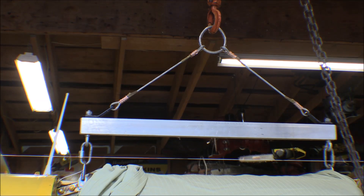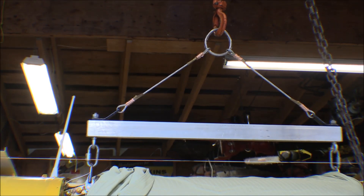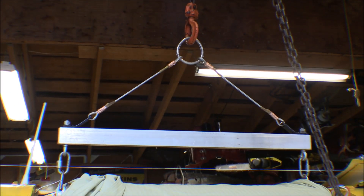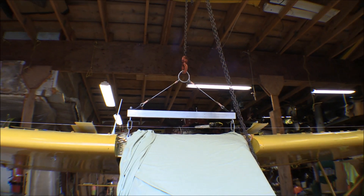So I need to lift this up — it's going to move forward when I do. The cat wanted to be held, and there was a little bird in the hangar he was chasing, but the bird flew up on the shelf where he can't get to it. I can hook my scale up to this, but I was talking to a friend who's got a fish processing company with a certified scale, so I think I'll borrow that. I need to get a picking point fixed up in the back so I can pick the back end of the airplane up, put a scale on it, do a weight and balance, then pick it up, take the bogey gear out, and start fitting up the floats.